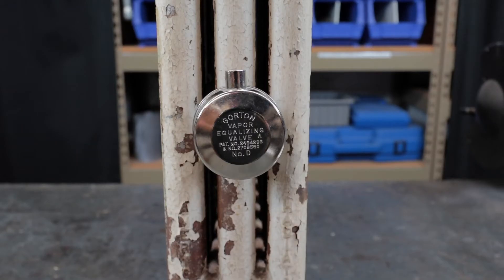What you're looking at here is a small cast-iron radiator — typical of what you may find in your home. It could be bigger or smaller, but as long as it's a freestanding cast-iron radiator and you have a one-pipe steam heating system operating at or below 2 psi, this is where this particular Danfoss is going to work.